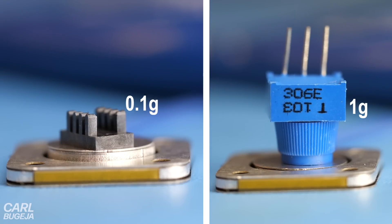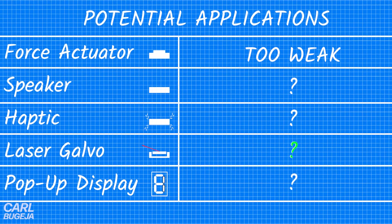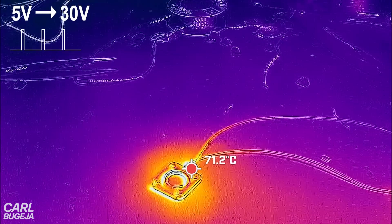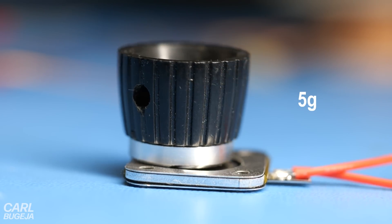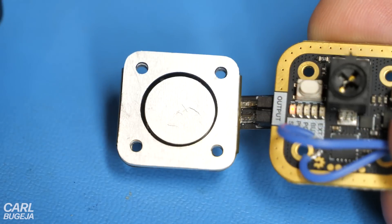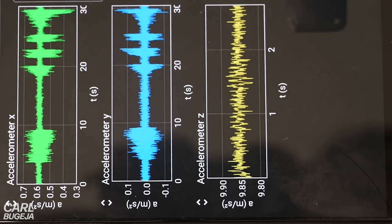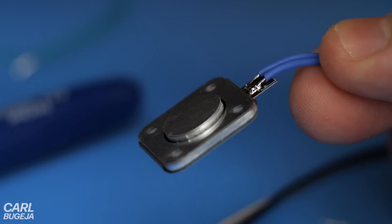It could only lift a few milligrams — barely enough to lift itself — so the force actuator idea is not looking good. The only way something like this could work is by boosting the voltage and applying short pulses to keep things within the temperature range, but one of these cannot even lift 5 grams. However, this actuator has all the right elements to make a buzzer or a speaker, so that is definitely a win. It also created vibrations, though they were not that strong, and at low frequency they were noisy.